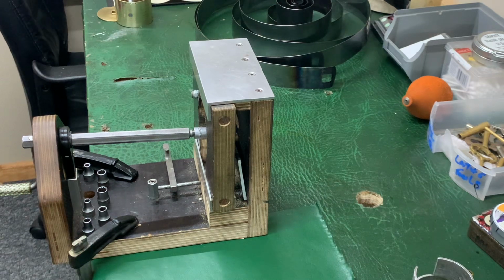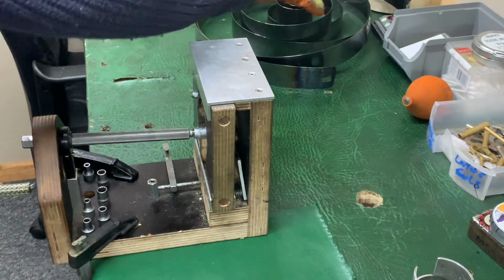At the end of the day, when I take the wire off them to open them up, we have an old apron here, a very heavy canvas apron. It's actually Steve's idea. We put the spring in the pocket of that, with a pair of gloves on, and clip the wire off. It can't open out much further than the pocket, and it's opened enough just to take its power out. So that's how we do that.